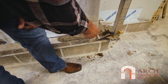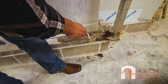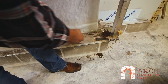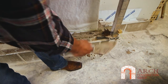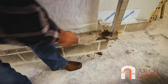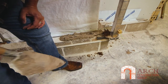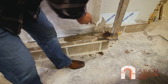Whenever we patch the corner pull hole, when we pull this pull out, if we point this void in we will get this area at that time. Remember: pull them as you go. If you're on conventional scaffold you can get to it, then patch it and point it as you go. If you're on a hydro or a crank, you're going to have to patch your holes as you bring the towers down. Always dampen it whenever you go to point it, because this will just suck the moisture right out of that little bit of mortar and it will set up differently than the rest. Make sure it's wet before you point it in.